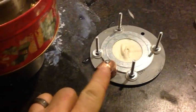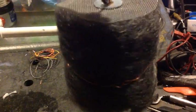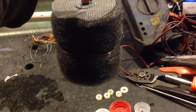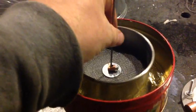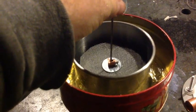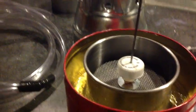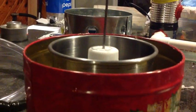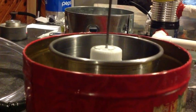This is a half inch copper street elbow. Here is the displacer — it goes inside like this. You want to see that it can move up and down easily. I have the spacers set in such a way that it's just a hair below the edge for where the bottom of the diaphragm is going to go.